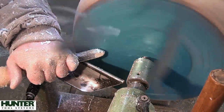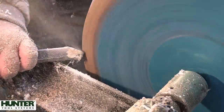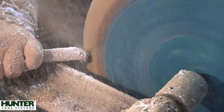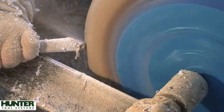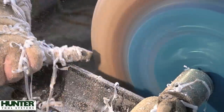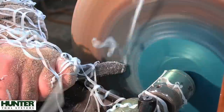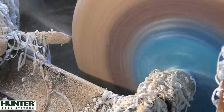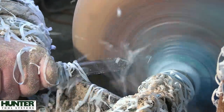This is the bottom of the casting and there's a lot of resin on the bottom because the bottom of the pressure pot isn't actually flat — something I overlooked. I would maybe put down a bed of rice to limit how much resin is sitting down there before the plastic goes in. The plan is to get at least a core out of this. I had those busted-off screws in one of them, so I only end up getting one of them, but at least we do get a second core. Here I'm just cleaning off the bottom, prepping it, getting it ready for the glue block because I don't really want to turn a tenon on this and take away from the height of it.